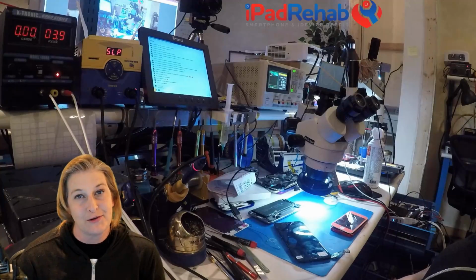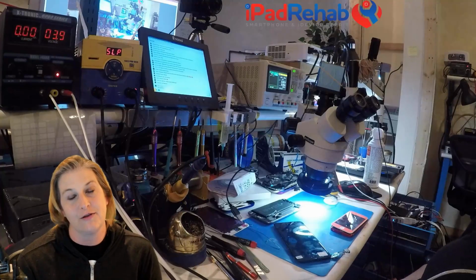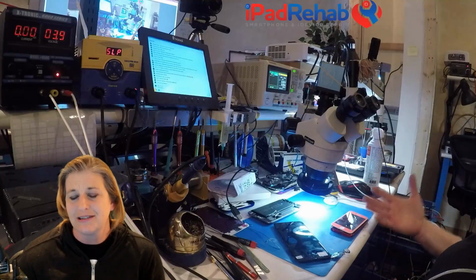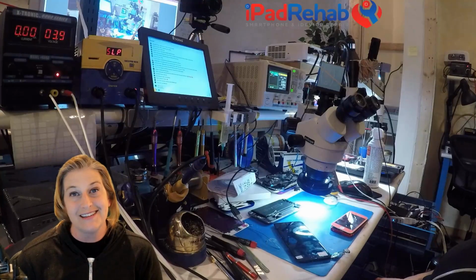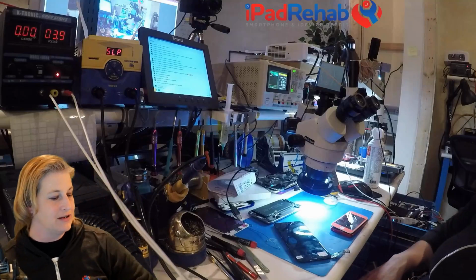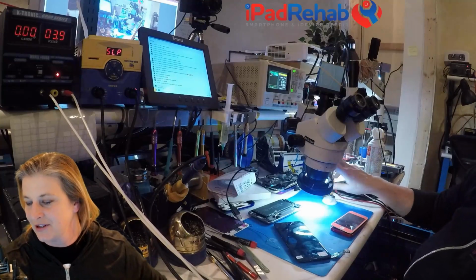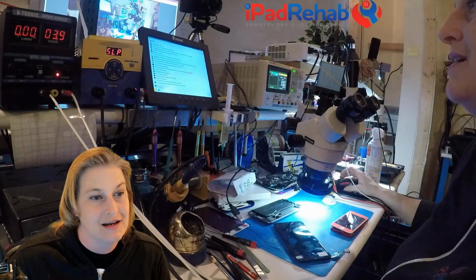Diode Mode compared to a known good board, and we found a partial short on that 6 volt boost line out of Chestnut. We talked about how you can't just blame Chestnut. Chestnut was fine. We had no image. Chestnut was fine. Why? Partial short on one of its outputs. All right, so that one I thought was a good one. It was unusual, and I really think that one had a lot of good lessons to teach you guys.